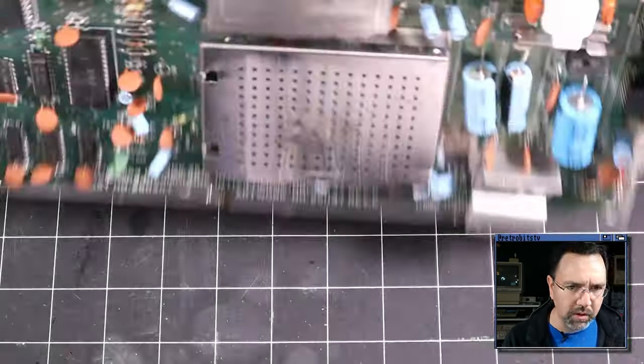And there's absolutely none. When we power the machine up, it's either not booting into a state where it's requesting the BASIC ROM, or the PLA isn't doing the right thing and switching the BASIC ROM into memory, or rather making it available when it needs to be. So the chip select line on the BASIC ROM is suspect, and I'm not sure if it's still the PLA or not, but realistically, we can't run the machine without a working PLA, a 6510 CPU, or a VIC chip. And we know that the VIC-II is sort of working because it is generating the PHI-0 for the CPU correctly, and it is outputting an NTSC signal. But we haven't popped the can open yet.